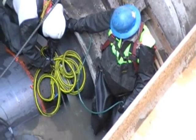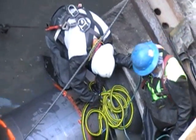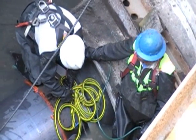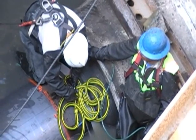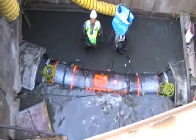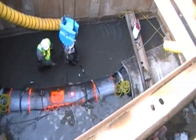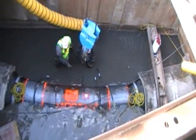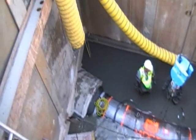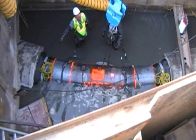As I pan back, you'll notice that there's much less disruption to the sewage in the pit, which will be pumped out now as all the flow has been diverted through the steel bypass tube. After the pit is pumped out, the tie-in can be completed, bringing the 54-inch clay pipe up in the lower left-hand corner into the other pipe.